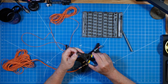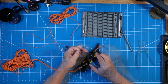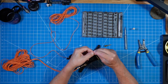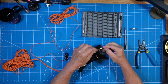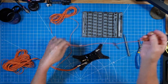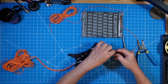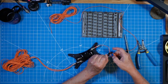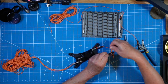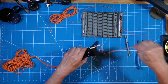Because I'm only putting one wire inside the radiating element banana plug instead of four wires on the radial side, I'm cutting the sheathing back extra long and folding the wire over once to get some bulk inside when I screw down those two lugs on the banana plug. Here I am with my radiating element — let's go ahead and plug it in. You'll see me get my S-clip on there and now you'll understand what I'm trying to pull off. There are holes available on the winder from Coffee and Ham Radios. I'm doing a last minute adjustment getting my radiating element positioned in the strain relief. And there it is — we have a finished product. It's time to go play radio.